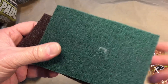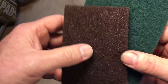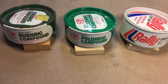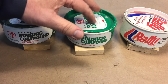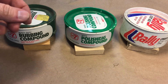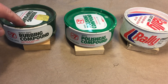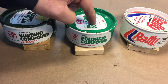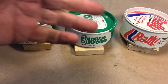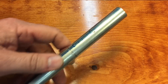What we use a lot of times now is Scotch-Brite — a type of wool but made from nylon. Again, it comes in grits or surface finishes, and you can see one is more fine and one is more coarse. You can also control your finishes with a liquid or paste medium. A rubbing compound has a more aggressive grit in it — if you feel it, it feels a little sandy because it's a much heavier duty grit. From there you go to a polishing compound, which is a finer grit, and from there to a wax, which has a very fine grit to help take the finish down.